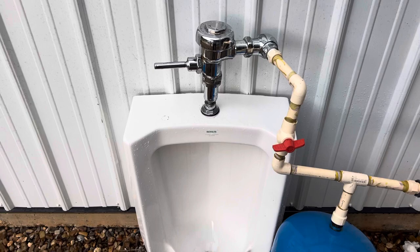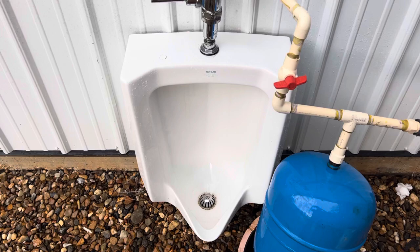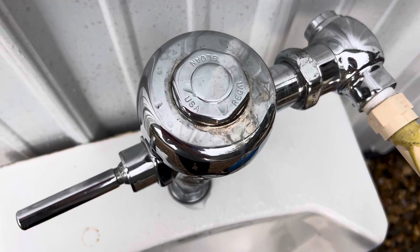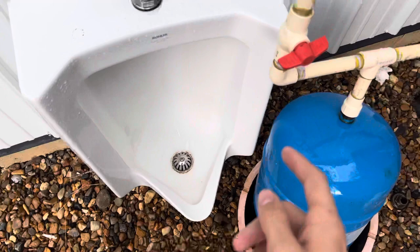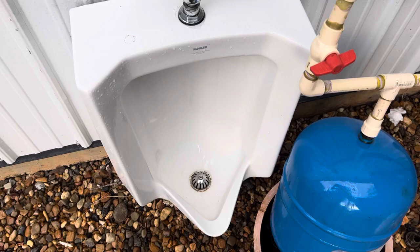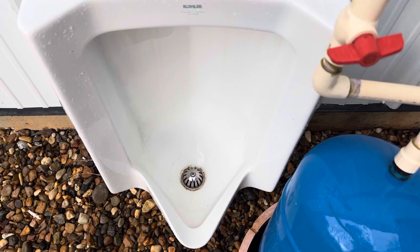I got this urinal from an abandoned nursing home. I actually filmed the place with this urinal installed before I was able to get it — I will leave the link to that video in the description if y'all missed it. I have it on a Sloan Regal flushometer, like a one-gallon diaphragm I believe. I have to adjust the pressure with this — not the control stop, because it's facing backwards. I do eventually plan to build a much better setup since this whole thing is kind of annoying. Right now I have the pressure turned up about how it would flush when installed, so here's a flush.